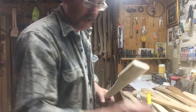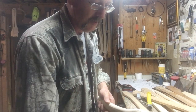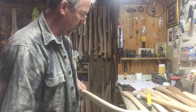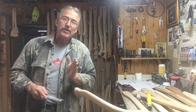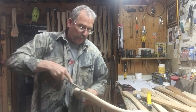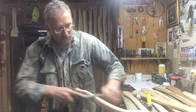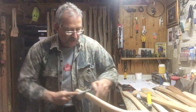The last thing I do is put it upright in the vise. Then I'll finish the back side and front side of the axe where your hand slides. When you're chopping wood, you want your hands to slide along the handle. I can see the ridge - usually I get a ridge along the back because I smooth it one way then the other, leaving a ridge running right along the back. With my light coming down on the side, I can see where there may still be a few little ridges. On almost every handle there's a few left, so I go along and roll those out.